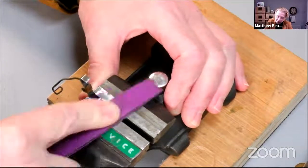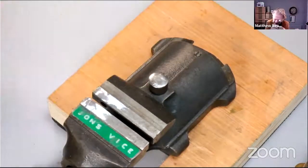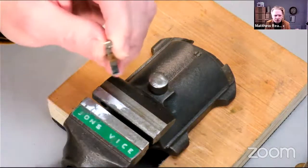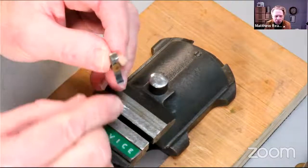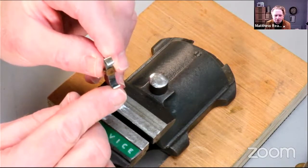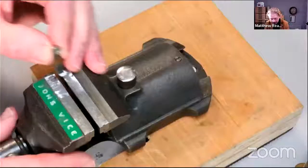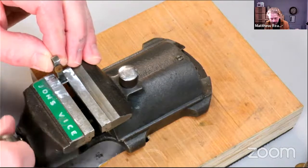If you're going to make new pallets, then you really have to do a drawing first. Otherwise, you're pretty much shooting in the dark. Right, okay, that's all right, actually. That's gotten us about a third of impulse space. We've now shifted back in the other direction. We've got two thirds impulse space on the correct side and one third still to go. So I'll just remount them.